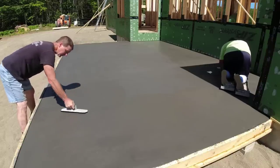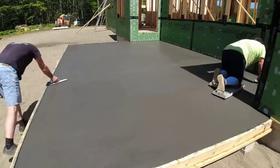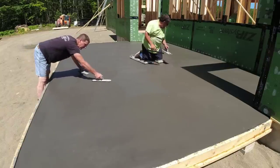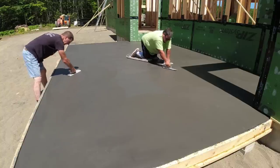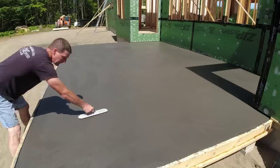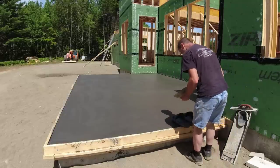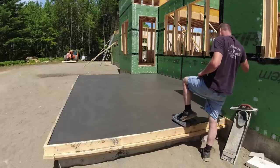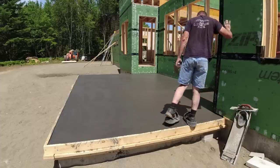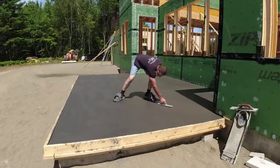Here we are getting on it with our hand trowels. This time Eric jumped on the skids and I'm getting it from the outside edge. A lot of times when I finish by hand I like using what they call a pool trowel — it's rounded on both edges. Sometimes when you finish with just square edge trowels like what Eric has, you tend to leave a few more lines from the sharp corners. With a pool trowel's rounded edges you don't really leave any lines from the trowel. Everybody has their preference, but when I'm finishing something smooth like this by hand I'll grab that one first. We've hit it twice with the skids, I hit it once with a mag, and Eric hit it once with a hand trowel. This thing's curing up really really fast.